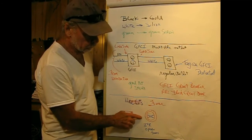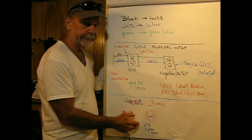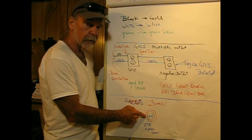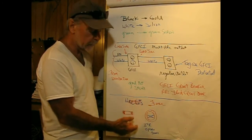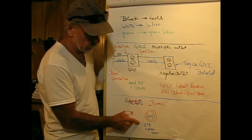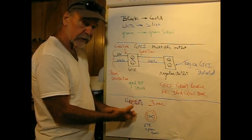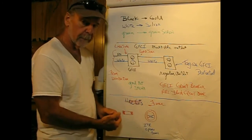But a fuse was basically like a light bulb socket, and now in current times they have a different pitch for different ampere ratings, so you can't put a 30 amp fuse in a 20 amp circuit. But basically it's a piece of metal that gets kind of thin in the middle, and I squared R causes that to melt if you're operating slightly above the rated current of the fuse itself.